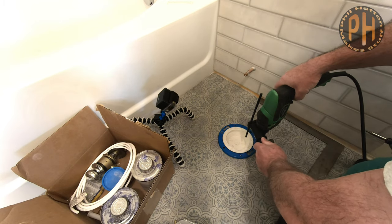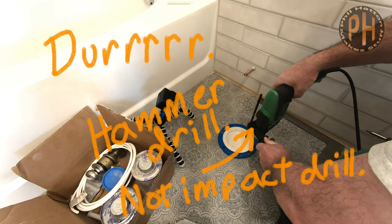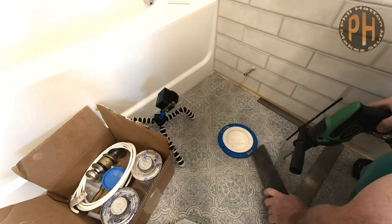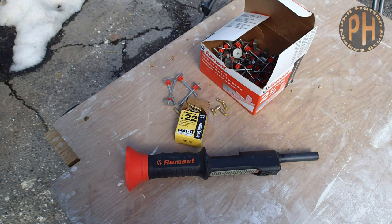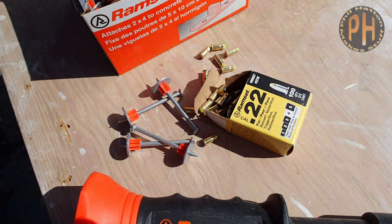If you are attaching a wall to concrete, you can rent or borrow an impact drill. I own a fairly light-duty one, but I've found that it takes quite a long time to drill into concrete and set in an anchor screw of one type or other. So I thought I would try using a powder-actuated nailer, and suddenly everything concrete looks like it needs a piece of lumber nailed to it. They use little 22 caliber blanks to fire a nail through the wood into the concrete.